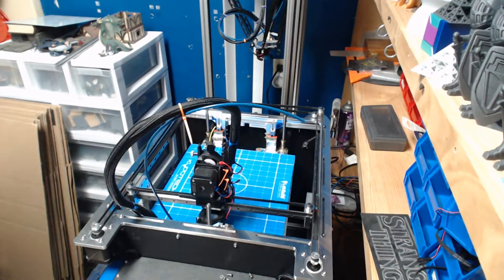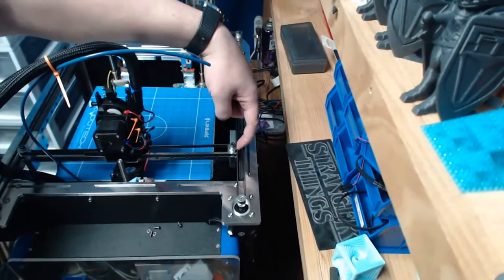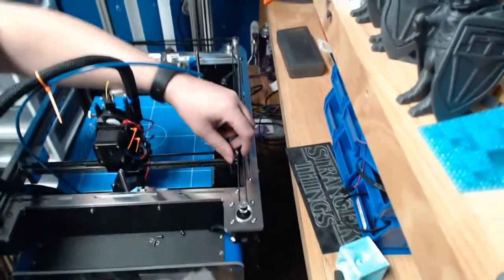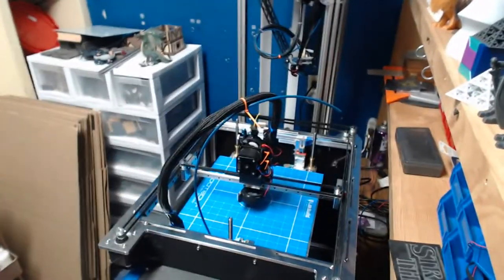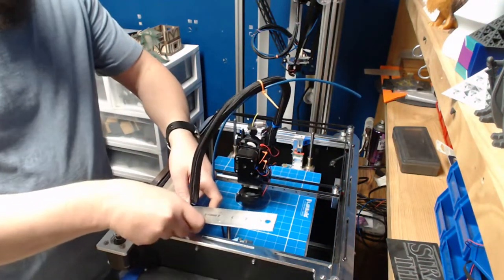So the big test of this, and I'm gonna pick up the camera so I don't get motion sick on me, is to see, I don't know if you can see it in the video, how parallel these belt runs are off of this pulley to this point and this pulley to this point on both sides. And I can tell you from just looking at this front one here, it is pretty much dead on. I have a square and I can check it versus the side of the halo.